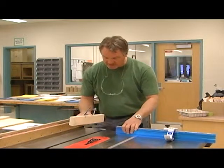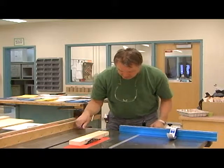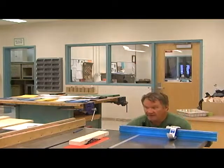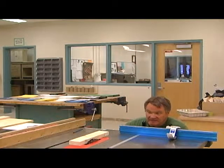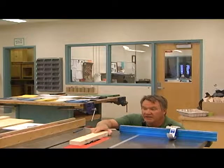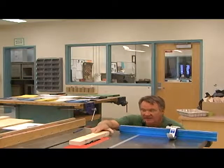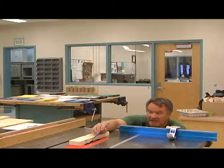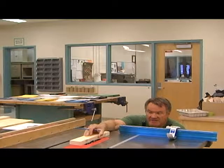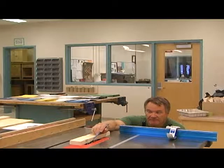Then I just have to mark my height in one place. First off, let's take care of the blade height. I put my piece of material down, unlock the lock nut, and get the blade at top depth, center — right to the blade height that I require. My blade height at its very apex is at three-eighths of an inch tall. Tighten that lock nut up.